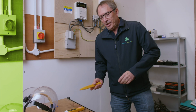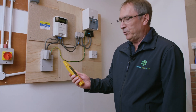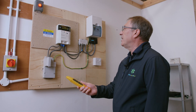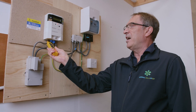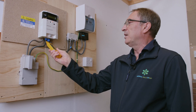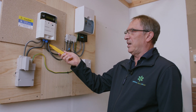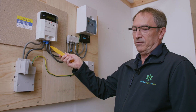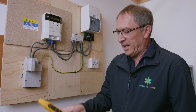The next stage for the P of PEPSI is your polarity. With your Tech 100, prove it, and now it's ready for using. Go across your tails, make sure that you're getting a live at the live point. Neutral, neutral, and again live coming out of the meter. We've proven that we've got the polarity correct into and out of the meter. Reprove, and then you finish that part of the polarity test.